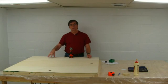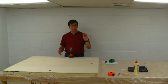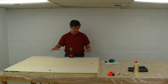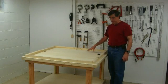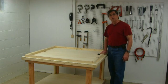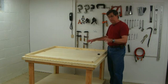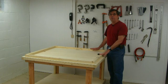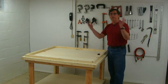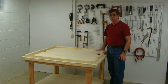Now that I've got the 2x2 framework underneath the plywood, I've got a layer of glue down and everything lined up, and all the holes have been pre-drilled. So next it's just a matter of taking inch-and-a-half wood screws and screwing the plywood down to the framework. Now that the enclosure base is completed, I put it on the stand. To get the upper framework mounted, I blocked it out with 2x2s in the corners so I could get it centered right, marked it, pulled the framework out, laid a bead of glue down, put the framework back, clamped it for a good half hour to 40 minutes, then flipped the entire assembly over and mounted screws in from the underside. So I know it's good and solid and won't break loose or move anywhere.